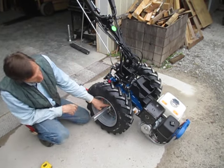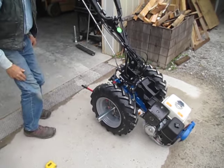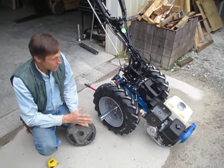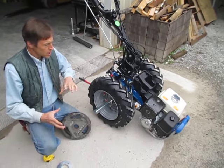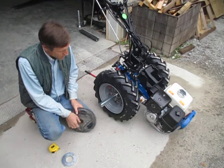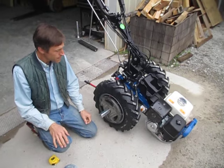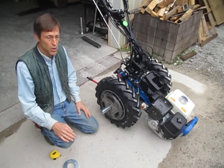Find the pin — these pins are a common pin available at any farm store; it's a 5/16th D-ring pin. The other thing I want to point out about this system is that it allows the addition of barbell weights. We have barbell weight hangers that we've manufactured for years that just bolt onto the center of the hub and protrude a 1-inch solid steel post to accept 1-inch center hole barbell weights, which are very common standard barbell weight plates. These won't accept the 1-inch, but they accept the big 2-inch Olympic weights — you just slide those right on there. Get another one of those pins and put it in the end to keep the weights from sliding off, and then you've got the ability to add wheel weight with adjustable axle extensions, which is something we couldn't previously do.